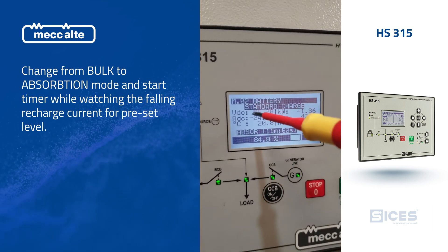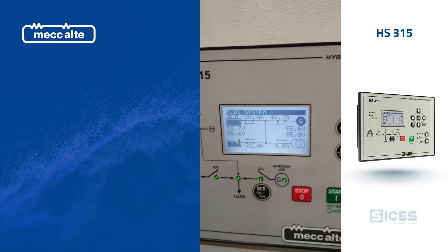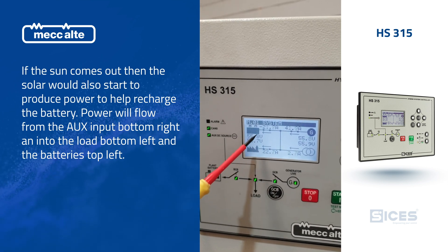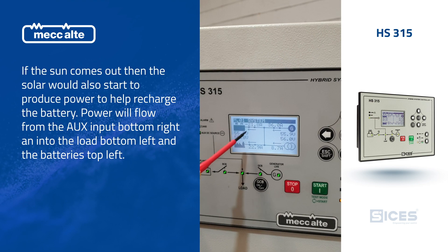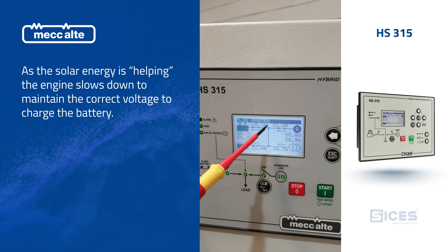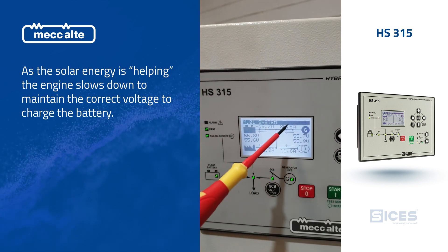I've got it set for 12 minutes. We'll maintain this same voltage set point but now the current will start to decrease. It'll stay in this mode until we get to 12 amps. What I'm now going to do is introduce some wind or solar — at the moment you can see there's zero. I'm turning this on now and this value starts to come in. We'll still maintain our voltage set point. The engine is slowly ramping down speed. We've got 9 amps of solar or wind coming in, still charging in our charging algorithm, and we're now only at 20 amps — the total generator capacity has dropped.